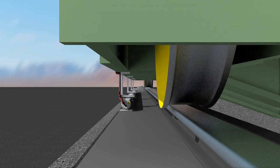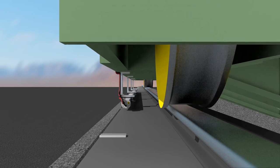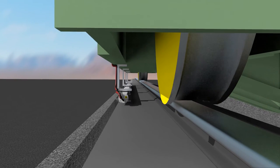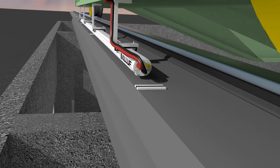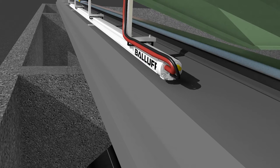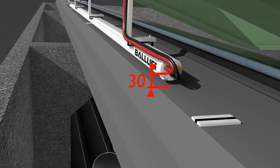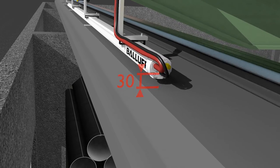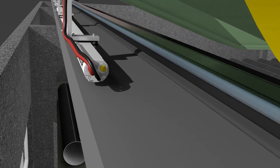Magnets along the X coordinate are selected in a way to eliminate possible vertical vibrations of a crane, which can reach 10–20 millimeters per unit width of a crane due to the wear of rails and wheels. The standard design of the Magnetrack system for crane positioning maintains reliability for vertical vibrations up to 30 millimeters per unit width. It's also possible to use larger magnets, which allows neutralizing vibrations up to 50 millimeters with a slight increase in implementation cost.